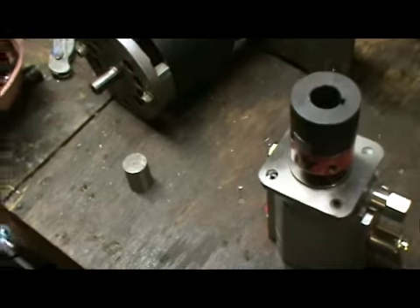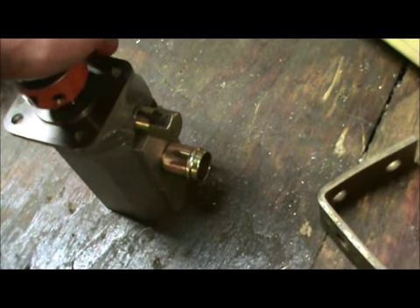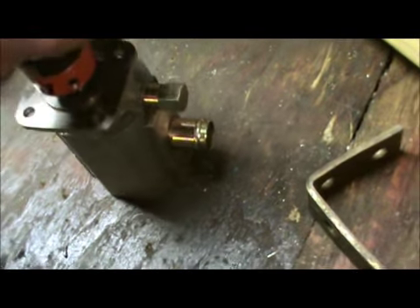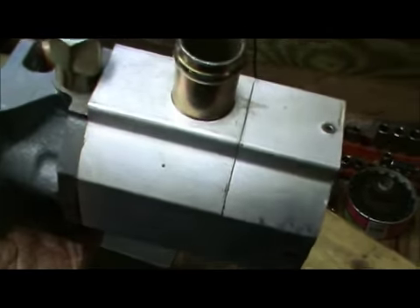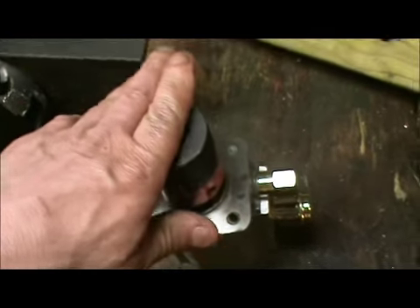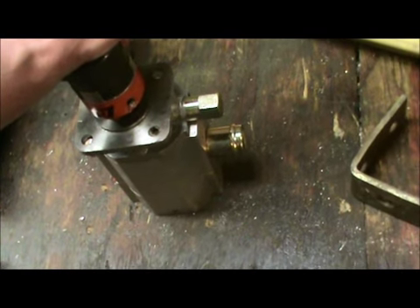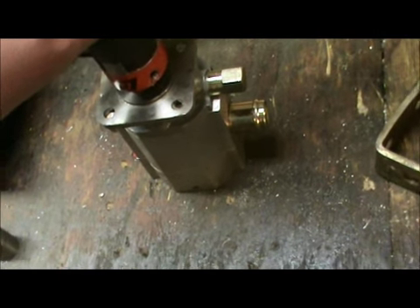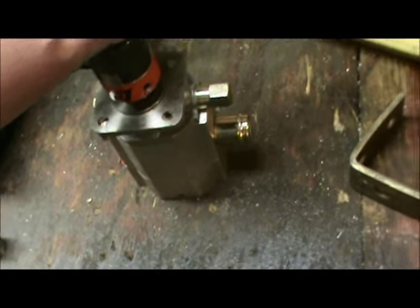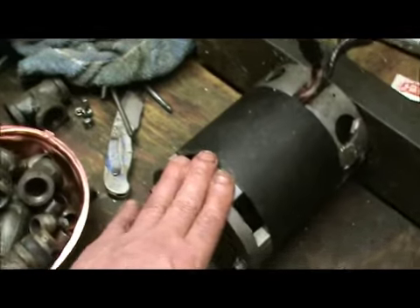As long as it works, that's good enough for me. I want to do a bench test on this with a 1/8-inch nozzle, or a .125 jet, and see what kind of thrust I can get with the pressure — because that would be very critical. If I can get 600 PSI at 9.68 gallons per minute, that would give me a huge amount of thrust. So I definitely need to bench test that, probably hooking it up to one of these motors.